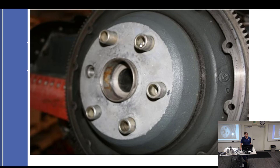It's supposed to be sticking out like that. But somebody put the prop on wrong, had a small hole right there. You're gonna be okay? Small hole. They shoved it over this one and just pushed the bushing right out the back. And if we were to turn around and look at the back, you'd see that bushing pushed way out and a prop bolt through it.